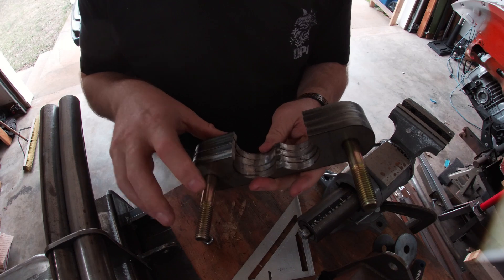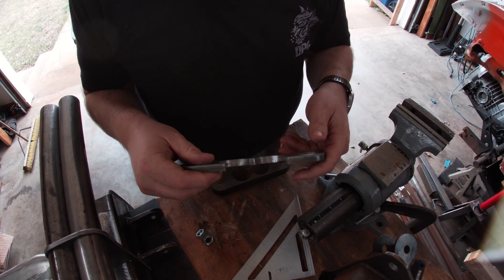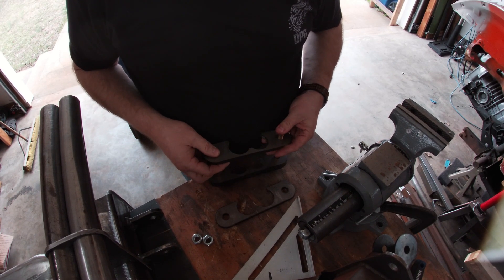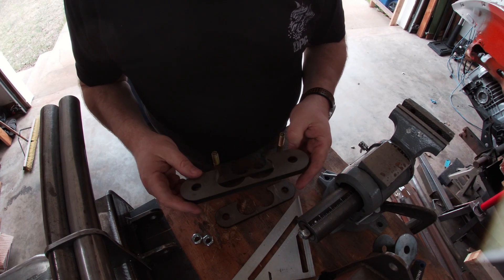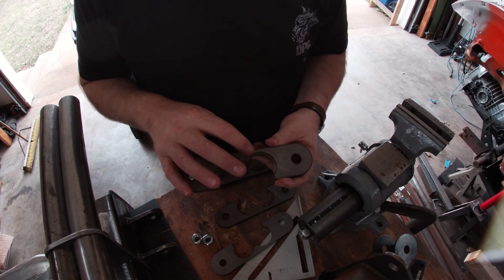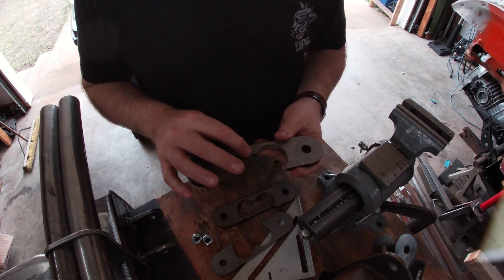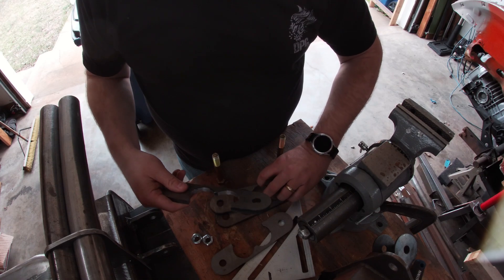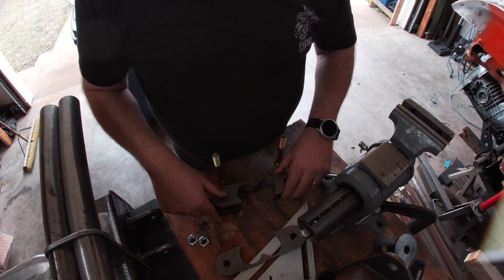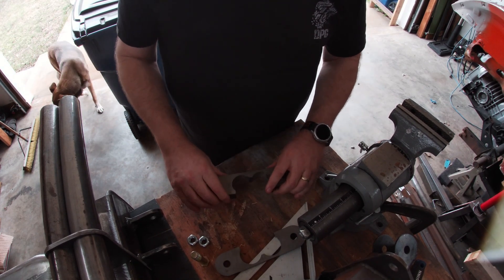What I'm going to do is — as you can see from all the black marks — I've marked these with how much I need to open them up. This one needs opening on this side, you can see the little black marks. This one here needed the most work, and this last one just needs to be opened up a skosh on a couple of spots. So I just need to open these up a little more, do some grinding, and that way everything will slide onto the tubes just like it should.